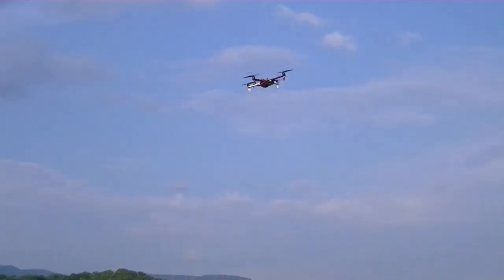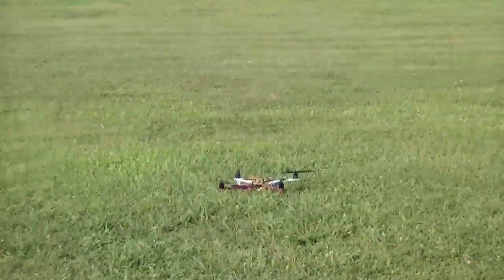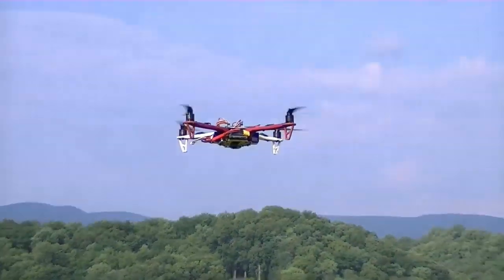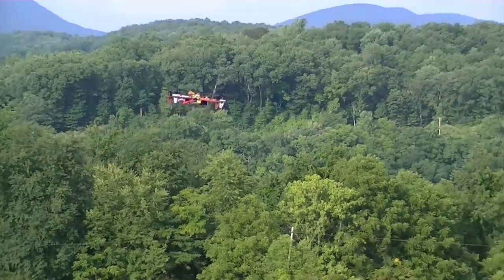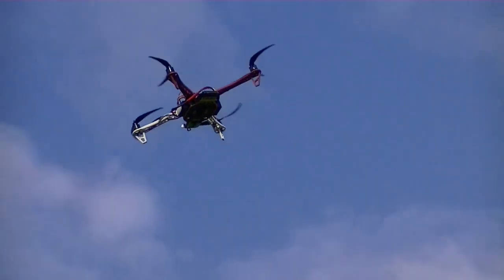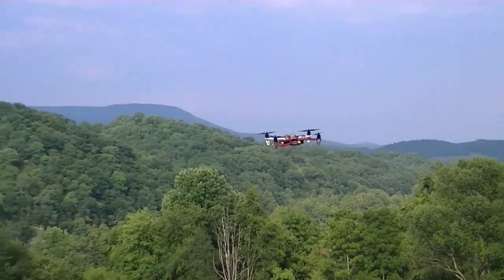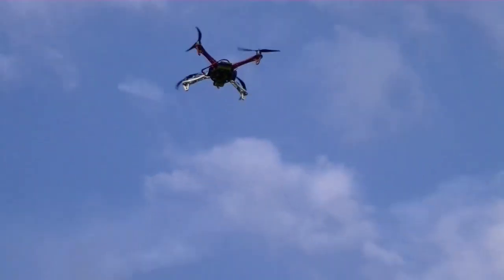It's going off right now — I can hear it. Just barely — fly it some more to see if we can get a rapid beep. It should go beep-beep-beep-beep when it gets a little lower. The beeps are increasing — actually shorter duration, pulsing faster. The faster it gets, the closer it is to the alarm voltage. When it gets right to the alarm voltage it should beep rapidly and continuously.